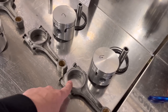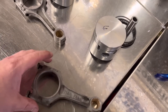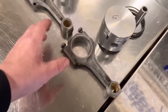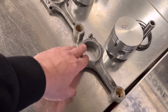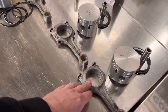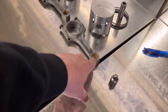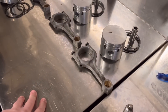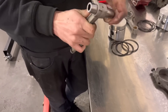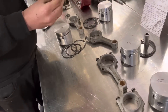Rather than resize those rods — because as I mentioned in a previous video, a couple of the caps are on the wrong way. If you put the caps on the wrong way and then torque the big end up, because you've got hollow dowels in there it shifts the dowels and those rods are going to be well out of true. So rather than fart about with those, Malcolm sent us a new set of rods, which we've balanced together. Paul checked the housings and they're spot on.